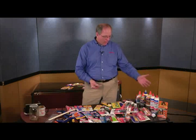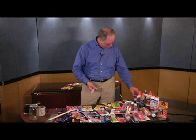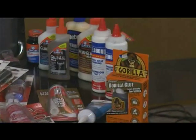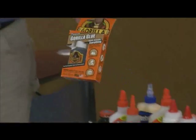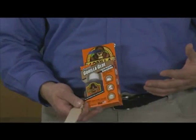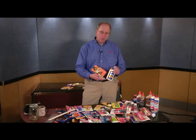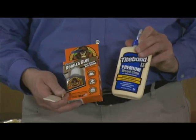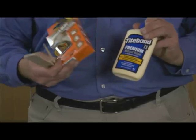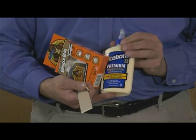So we have a lot of different types of wood glues. Whether you're familiar with Weld Bond, Elmer's, contact cement, or Gorilla Glue. Gorilla Glue is a urethane-based glue — thinking Gorilla, thinking super strong, you're right. Compared to a regular yellow glue like Weld Bond, Gorilla Glue is going to be a lot stronger. They're both slow-setting types of glue, which is generally what we want when working with wood since you're piecing things together.